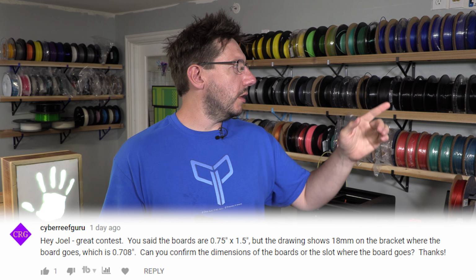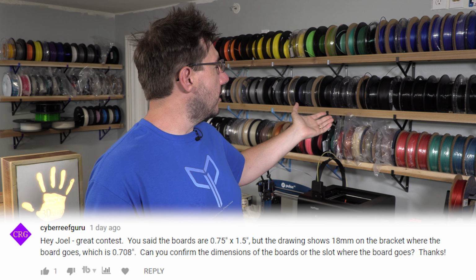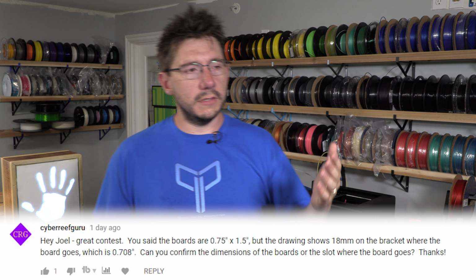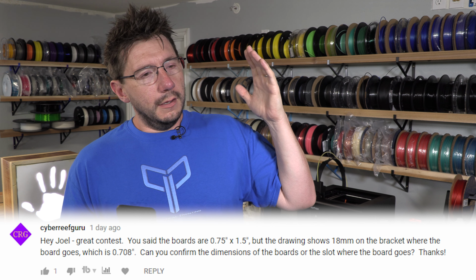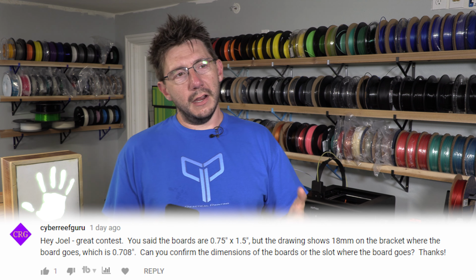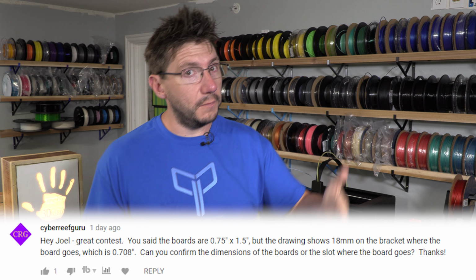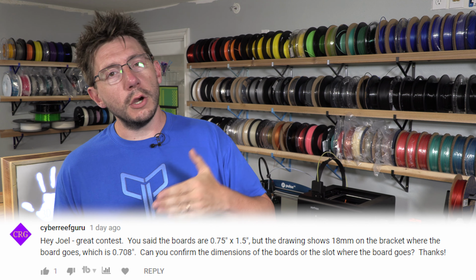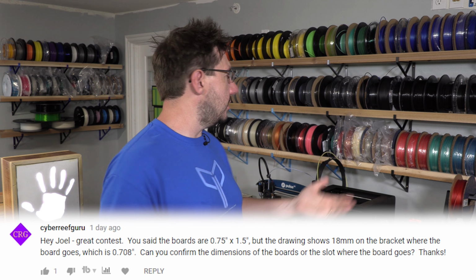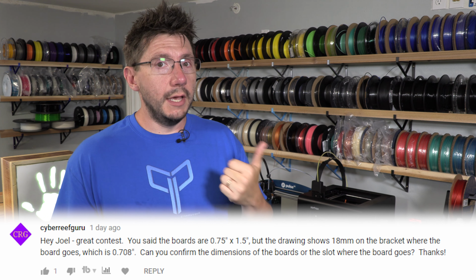And so what I did is I took an average measurement of the boards in millimeters across the length, which ended up being, well, it was 12 feet, and it was between 17.25 and 18.45. There was variance there. And so I just picked 18, thinking that if the board was smaller, it'd still fit. And if it was slightly larger, then the wood is soft and it can be pushed into the PLA plastic or the PETG plastic or whatever plastic I put up there and fit just fine. And that seemed to work just fine.